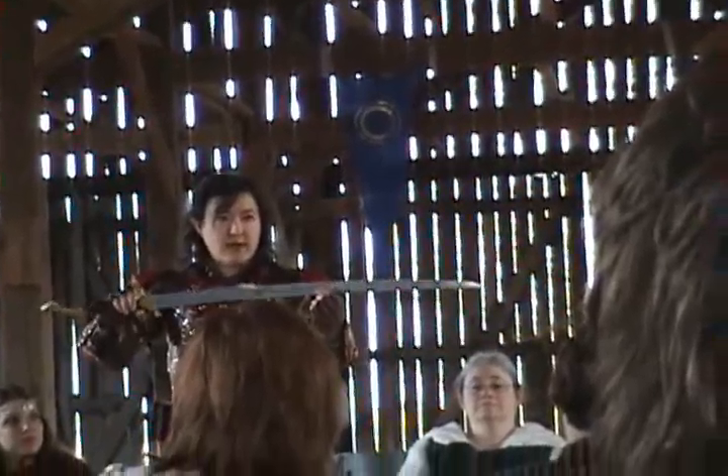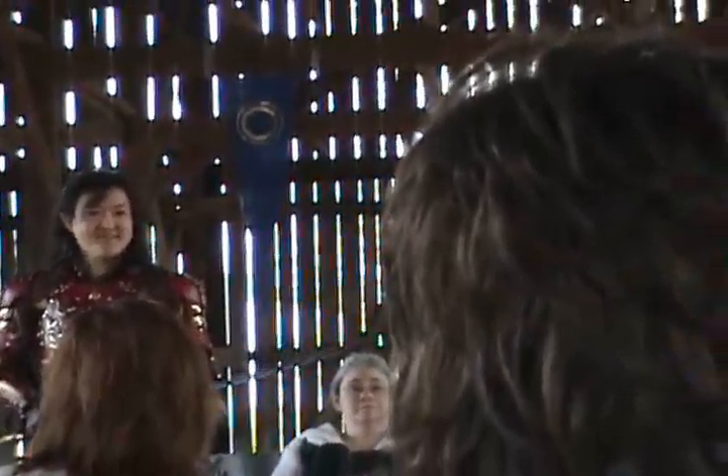When you grind it out, it starts as a straight bar, and then I draw a pattern on it, and then I have a grinding jig that I made that I can set at various angles for the bevel. And so you just sit there and grind it out.